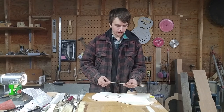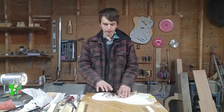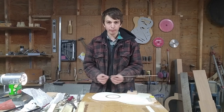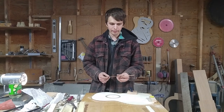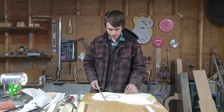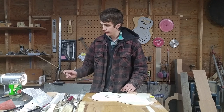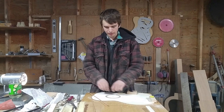These pieces here are a little bit too thick, but that's fine because I have to sand them down anyway to get them to fit. I used my table saw to cut them because I don't have a bandsaw here — this would have been a lot easier on the bandsaw and drum sander, but that's at my parents' house in dad's basement. So I'm going to thickness these down by hand to fit just right in the slots. I have my bending iron heating up so I can bend the pieces to put them in.